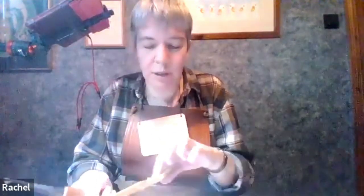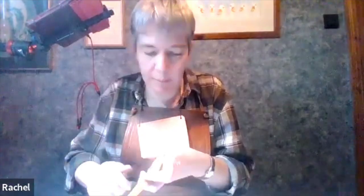So I'm checking that nice curve there, but I'm also checking that I haven't changed the angle at the front of the bowl. And I'm also checking to see how it might look side to side, though it's hard to properly do that at the moment. You can only really do it from the end to check that your two sides are the same, because you still have the bumper material in the middle.